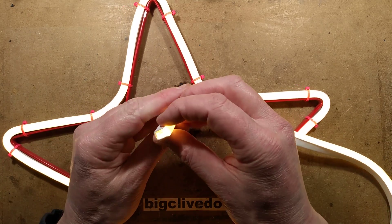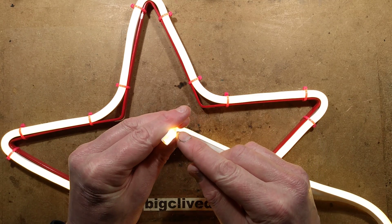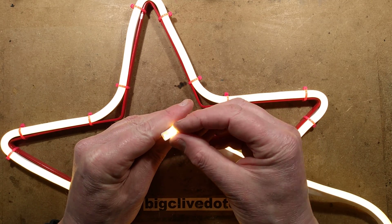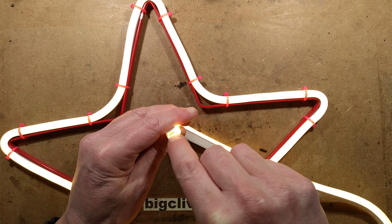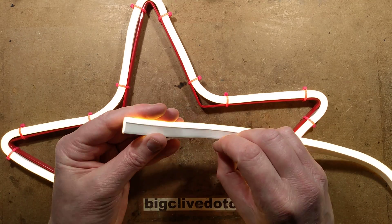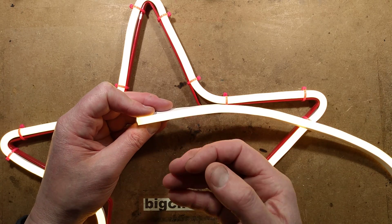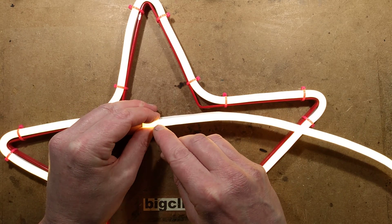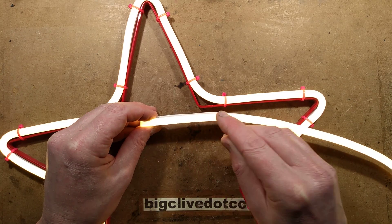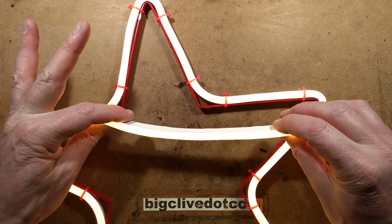The construction is also different to Neon, which limits the shapeability somewhat. It's got a fairly rectangular section with a domed end, and the LED is actually in the form of a tape running in the lower white section, firing sideways. The reason it does that is so you don't get a direct image of the LEDs — because if you did you'd get that characteristic spotty LED effect. You don't get that with this at all. It looks like a fairly linear stripe of light.